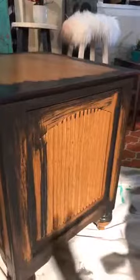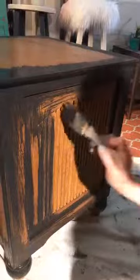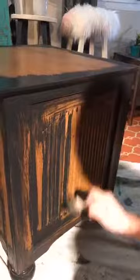All right, so let's talk about the technique real quick here. How many times do you wish that you had a piece of furniture that looks this color, but you want a black undertone to it? You don't have to paint all your piece. You just paint the pieces where you would bring through some of the black. So instead of painting it all over black and then trying to distress off the top color to show the bottom color, which is going to be like a brown or a black, especially if you're trying to create a darker effect for the base.